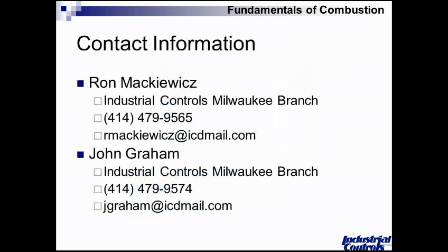Moderator Jen reads a question from Tom: Does the fuel have to be carbon-based? Yes — the free carbon is what combines with oxygen for heat release. That can vary quite a bit in fuels like oil. Fuel oils, for example, have a varying carbon content. If you're a large consumer of fuel oil, every time you get a new tank or shipment, you might retune the burner because the characteristics vary. But ultimately, yes, we need carbon in the fuel source to burn.